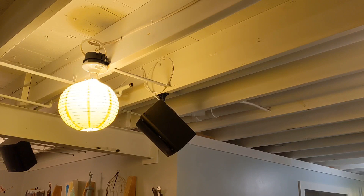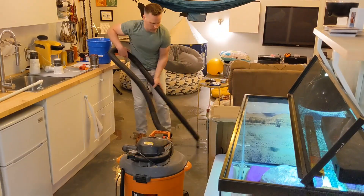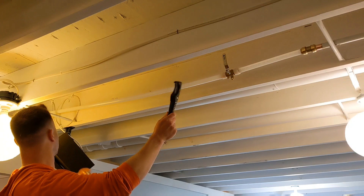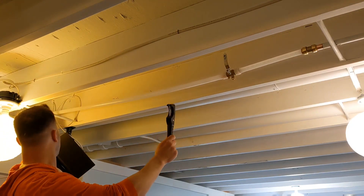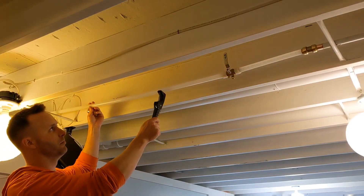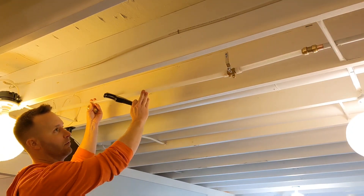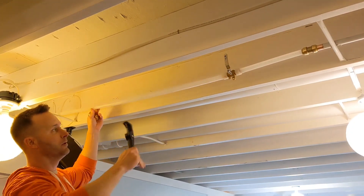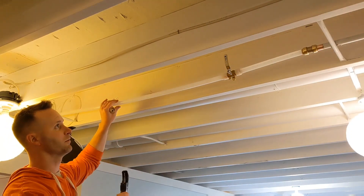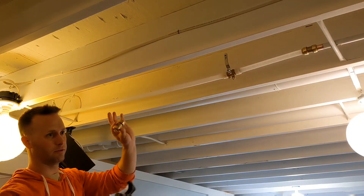Yes! Done. Here is the hardest part — going to connect this long portion to here. Well, it's not going to be that hard. The big reason I wanted to go to PEX is because it's so pliable and bendable. You won't need to deal with being exact or slip couplings or anything like that with solder. You just kind of bend what you need in slack and then slip it on.